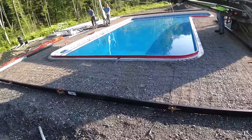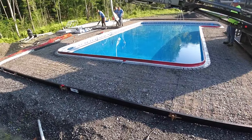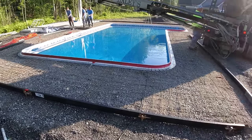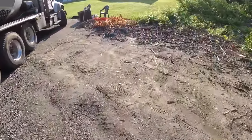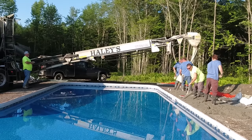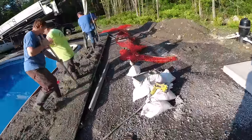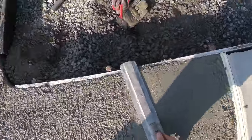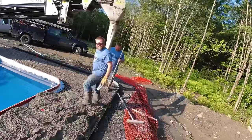975 square feet here we're pouring today, so we're definitely gonna be hustling. We got a water reducer in here too, so we can pour a little bit looser slump than that. I'd say that's probably around a 5. We could pour a 6 really easily here today. So we're gonna get going. He's gonna give that just a little bit more water, get the slump up to where we want it. Probably give it a little bit more.